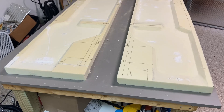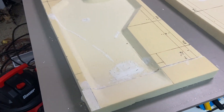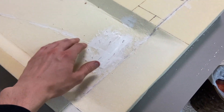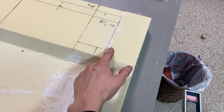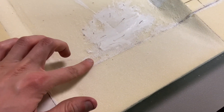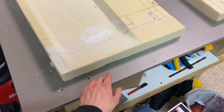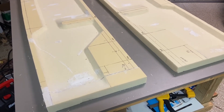Finally, after about a month of extra work, I have the left fuselage side matching up to the right again. The piece that snapped off has been reattached with micro balloon mixed with epoxy. The area that was low before has been patched, and we have a new forward section added — I cut everything off from that point forward and this is a new block of foam that's been sanded to match the contour of the other one. As far as smoothness goes, it's very difficult to tell where this seam is. There are a few spots I'll have to sand down and adjust with the fiberglass, but it's very close and this gets us back to where we can finally begin fiberglassing.